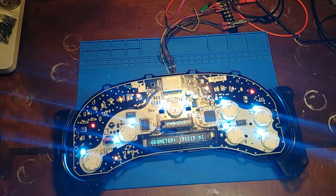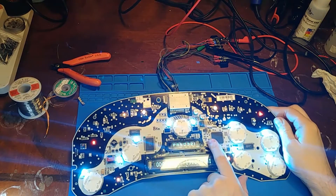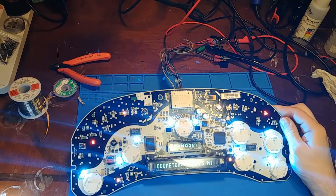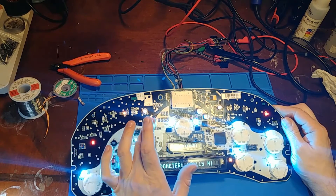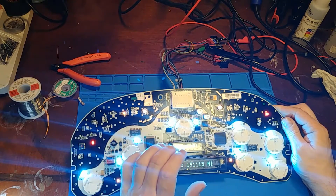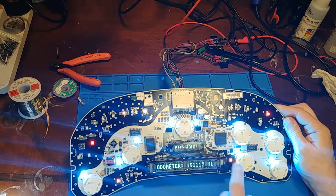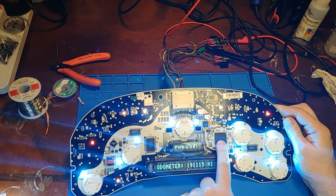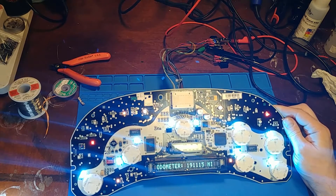So far, so good. I guess I can't blame this one on ESD damage. After removing that goober, it's been rock solid. I went through and cleaned up solder joints, made some proper fillets. So if Mike is watching, he should be happy. The goober was between the EEPROM and the microprocessor, so it makes logical sense that that would cause issues with the microprocessor talking to the EEPROM.